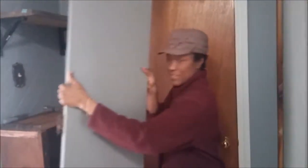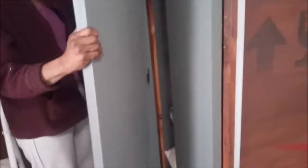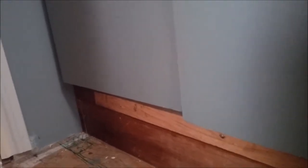If you want to do it by yourself, at the base where the doors will sit at the bottom, basically just put a ledger board at the base. I used my level to make sure the wood is level and screwed it in. Then I just rest my doors on top of the ledger board, which gives me leverage so I don't need anybody else to hold the door for me.